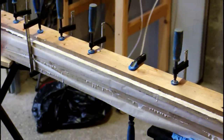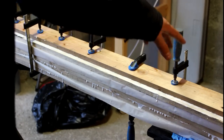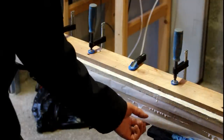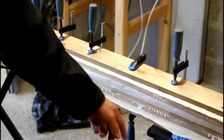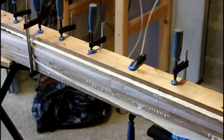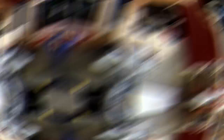That's the glue-up done — going to leave that overnight. It occurred to me that joining the edges on these boards before the glue was pointless because I'm going to have to do that again. I've only got a few clamps left — I do need to invest in a few more. Some tracing paper, baking paper, or greaseproof paper — whatever you guys call it in America — layered in between each set of boards should stop them being glued together. That's going to take a few hours to glue up so I'm going to leave that again overnight and call it another day.